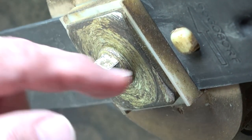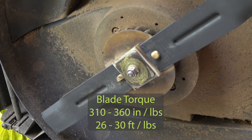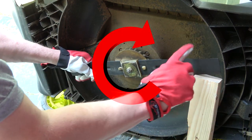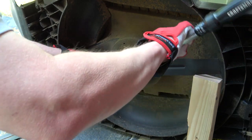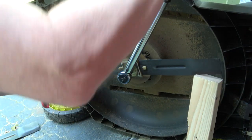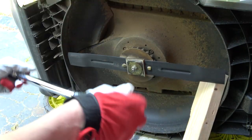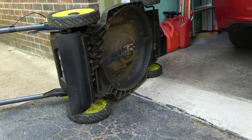This is what your installation should look like. Now set the fastener to the specified torque, which is 310 to 360 inch-pounds or 26 to 30 foot-pounds. Again, you're going to be wearing gloves. You're going to place a piece of wood — since we're going clockwise, prop the wood in the opposite direction. Attach your torque wrench and torque until you hear the click. I decided to go to the high end at 30 foot-pounds, since that will ensure it doesn't come loose throughout the mowing season.